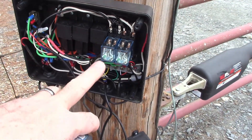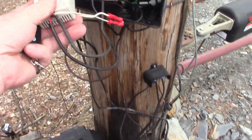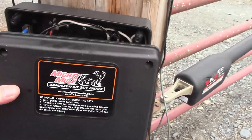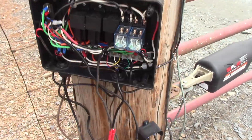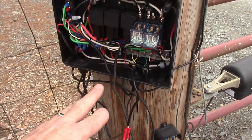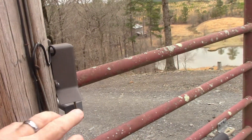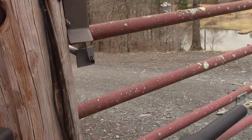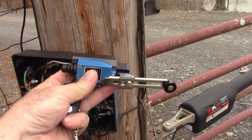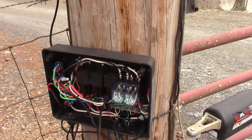This is the opener circuit itself and this is the remote control down here — I just keep it up inside there and the cover goes on to keep it weather tight. In order to hook it up once you've made this part, you need a limit switch for the opening part and another limit switch for the closing part, and I'll put a link to those in the description.